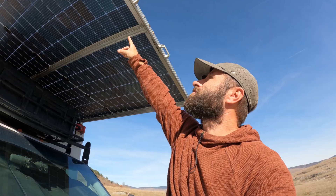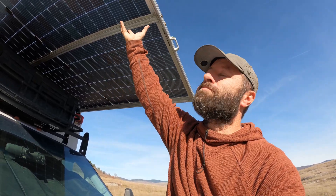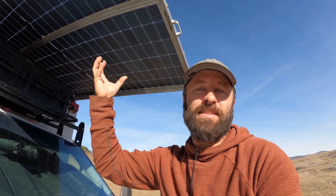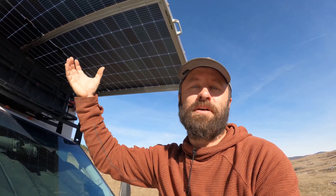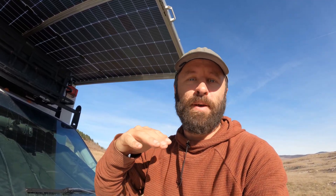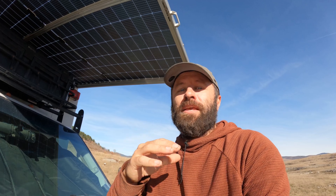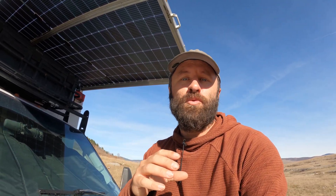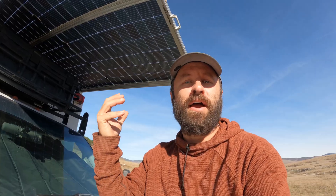You can see on the underside the cells are actually pretty much just see-through, and the light just reflects off and you get that increase from the bottom side of the panel, which is very cool. The 550 watt rating is actually only for the top of the panel, so in reality we technically have more than 550 watts per panel if we're getting that reflection.